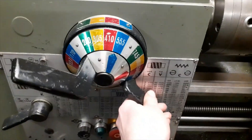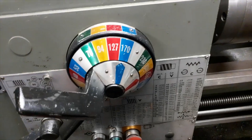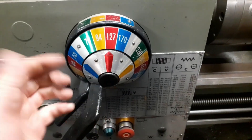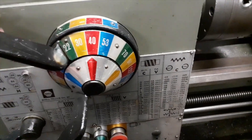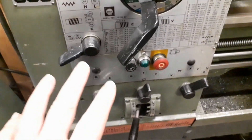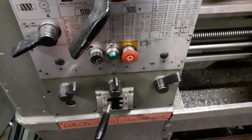This is your speed selector — quite simple. You've got an outer ring with colors, arrows with colors, and colors at the top. When you turn the outer ring you've got to make sure they all line up so the gears are meshed in. This gives you your speed, so when you're on blue it's 170, red is 127, and it goes all the way from 22 right up to 1800.